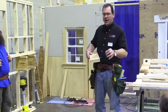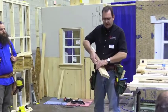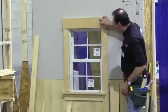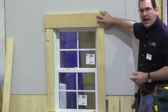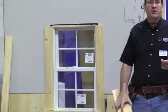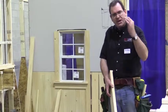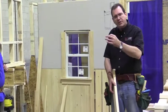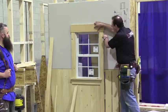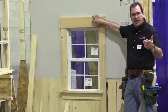We've got a piece of five-quarter - we'll talk about the pack-out in a minute. Typically we've got five-quarter and maybe three-quarter, giving us about a quarter-inch shoulder. The question is whether we're going to wrap that around. Not necessarily - I tend to study historic details. In a craftsman style casing, it wasn't always just a quarter-inch projection beyond the plane of the casing face. It was rarely just a quarter-inch projection beyond the end of the casing.